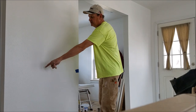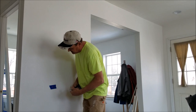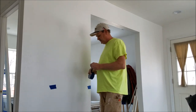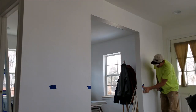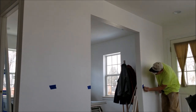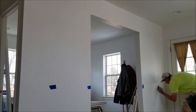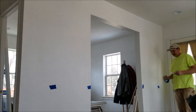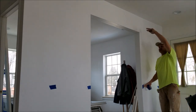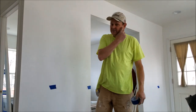I've got my tripod, using benchmarks on the wall — I've got a dot here and a dot there that's level. I'm going to do the same thing over there in two spots. You don't want to mark up the wall with fresh paint. All four of these dots are perfectly level with the laser level, so now I'll be able to measure up each point for the hardware for the barn door and get it totally level. I guarantee you it's not perfectly level in this old house.